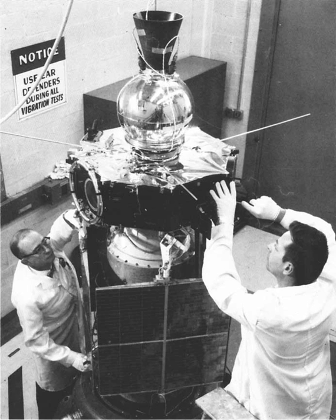Spacecraft interference was less than 0.125 nT. One vector measurement was obtained each 5.12 s. The bandpass of the magnetometer was 0 to 5 Hz, with a 20 dB per decade decrease for higher frequencies. Except for the flipper failure, the experiment functioned normally from launch to spacecraft turnoff.